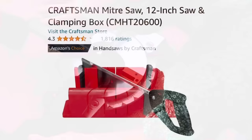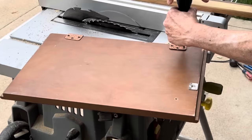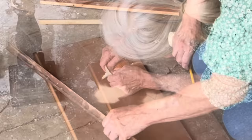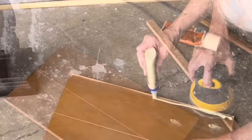If you don't have a miter saw, a hand saw and miter box would work just as well. The wood split just a bit, but it won't be noticeable once I'm done. Next, I removed the hardware from an old cabinet door that I bought at the Habitat Re-Store for $1. I marked the center of the back side and sanded a spot where I would attach the candle stand. Before putting the two parts together, I went ahead and filled the screw holes with some wood filler. I also cut a scrap piece of trim to fit across the bottom of the door. This would create a ledge to keep the book from sliding off. To create better adhesion, I lightly sanded both pieces where they would be joined together and then adhered them with wood glue and a few brad nails.